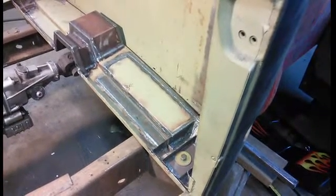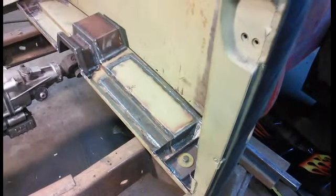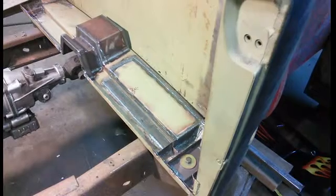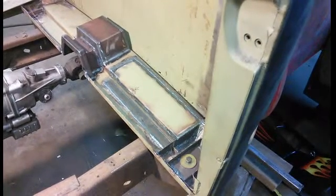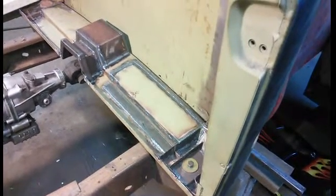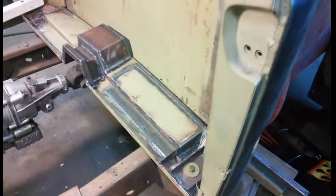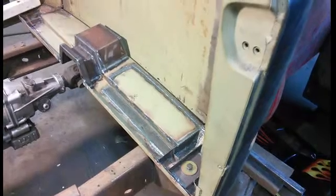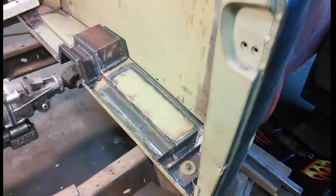And then I made that little driveshaft tunnel so that I have clearance around the driveshaft, and also that it's not too high because I want to have the stock seat height. And I couldn't reuse the seat anyways because it was sitting on pegs, and I have to have a seat that's on adjustments to slide forward and back, and it has to be bolted in.